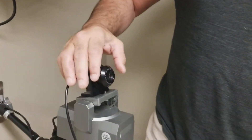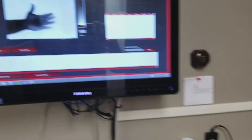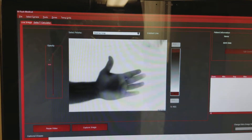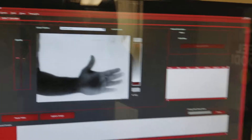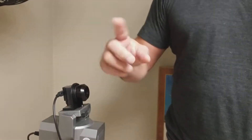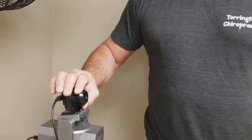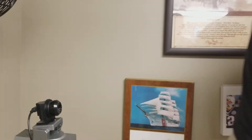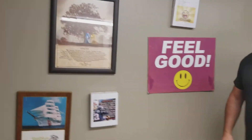We would put our hand at 18 inches, look at the screen, and we would turn the focus ring — and we can look at this now over here — we would turn this until we have clear focus on the actual screen. Then we'd make little turns with this, then go back to about six feet out, and we'll need an assistant to actually turn it until that looks clear.